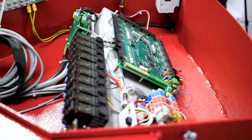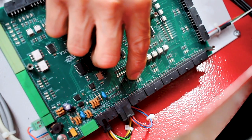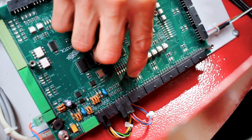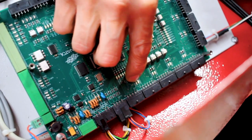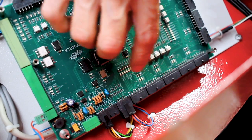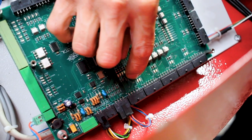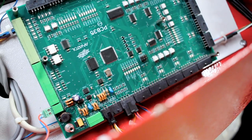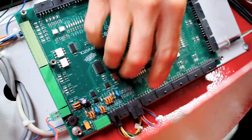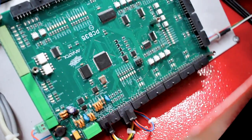Until we get the main control panel with the touch screen on there, these are your inputs and outputs for your front and rear sensor or your print heads. If you ever have a question about whether your sensor is working — sometimes even though the sensor might be lighting up it might not be sending the input or output — you can actually test them by bringing the head carriage forward to light up the front sensor and you'll see an LED light up here, then push the carriage back to light up the rear sensor.